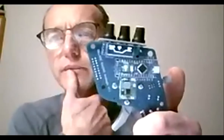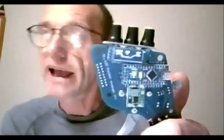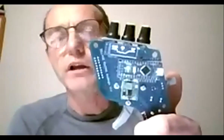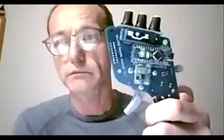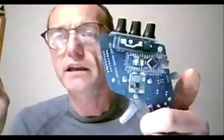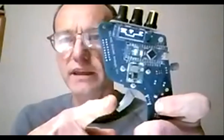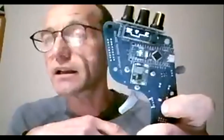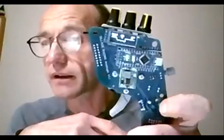ESP. ESP, it's electronic stability program. But in slot cars, it's the time the power goes to the engine. The delay. Is that still on the braking side? Yes, it's not brake. It's a resistor control system. It pulses the electricity to the motor. It's the same thing as a pulse width modulator controller.